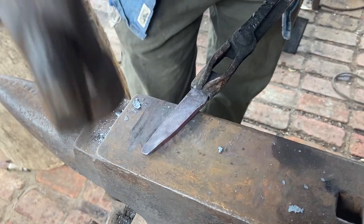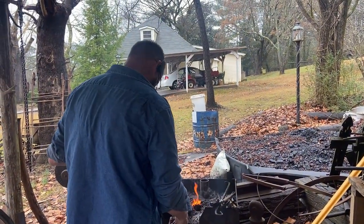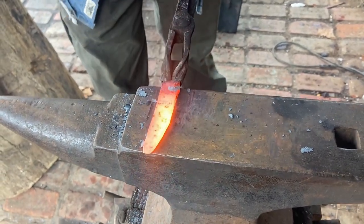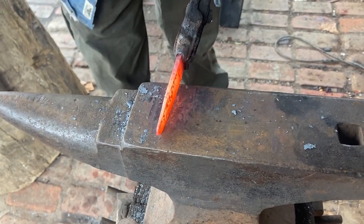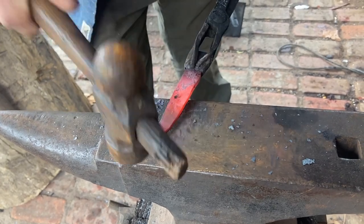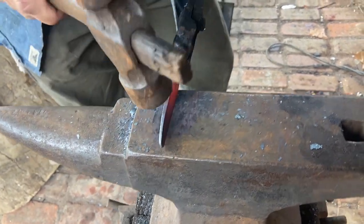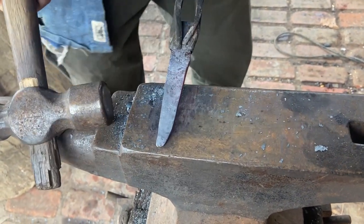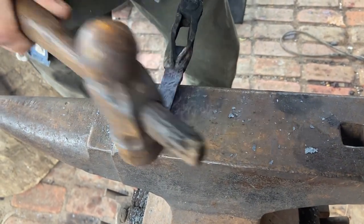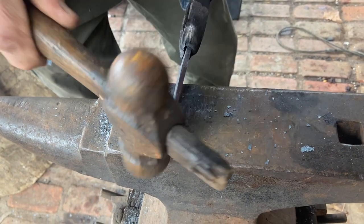Knocking everything off the handle here — it's getting pretty thick, it's going to be a lot of hammering to get this baby to where it needs to be. This stuff forges out really good, it moves really well. Like I said, if you're just beginning, or if you're having any trouble with splitting and cracking using the old spring stock — the old 5160 and that sort of thing — try some 1084, you might like it. It's a lot more forgiving than some of the harder spring steels, a little easier to forge, and it don't act up as much in the heat treat if you're not well versed in it.